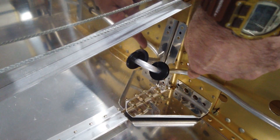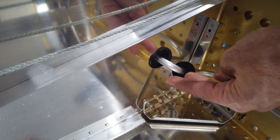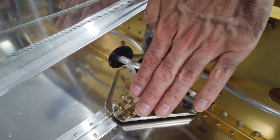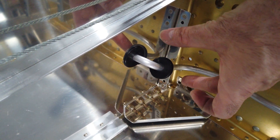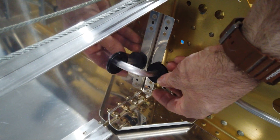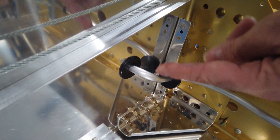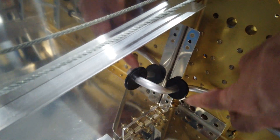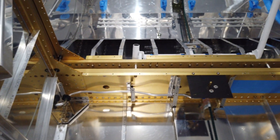This line runs downhill at an angle from this penetration to the center of the grommet cutout — but that angle does not match the angle of this bracket. So if you just run this straight, the grommet won't fit right on your cover plate. The cover plate is at one angle and the grommet will try to follow the tube at a different angle, giving you problems. So this leg of the tubing has a slight bend so it sags down a little, making the grommet angle match the angle of this faceplate.